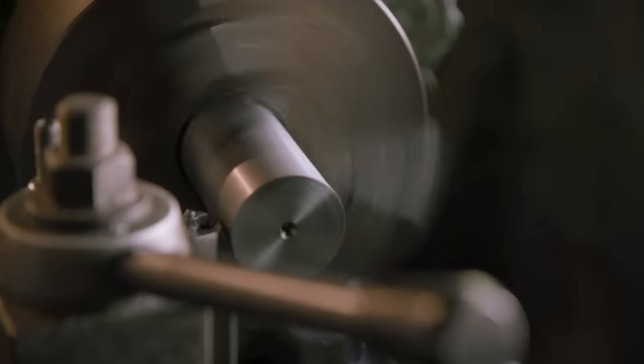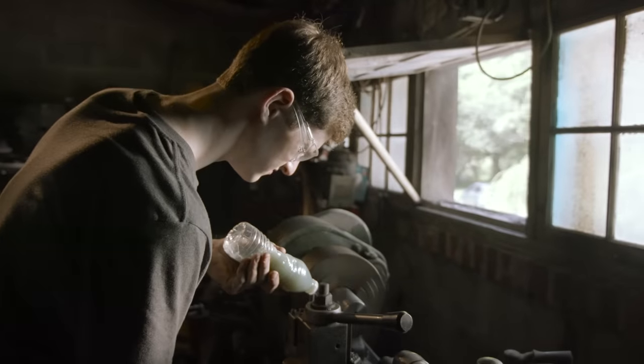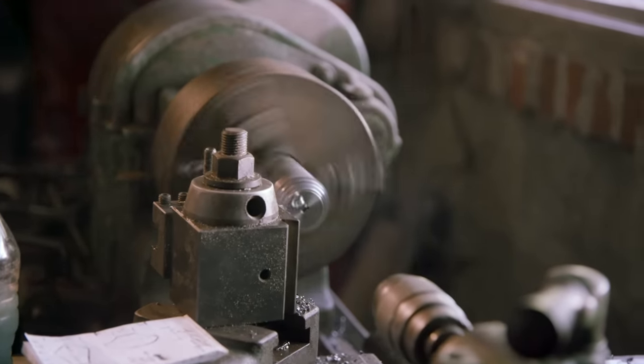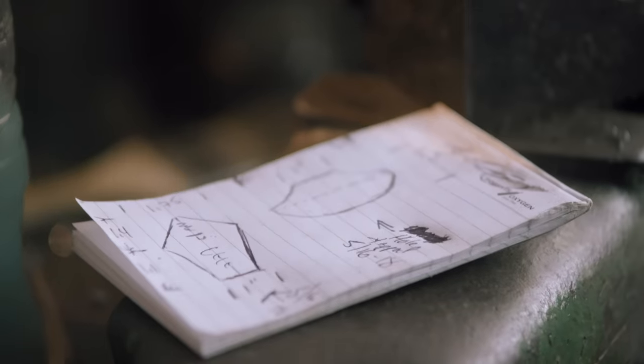From a fairly large piece of steel, Tanner begins cutting the pommel. It's going to be made in two separate sections. The primary reason for this is Matt's going to come back and do the faceting on the lower piece. While it could be done all on one piece, it'll be far easier if there's two and we can then put them together.